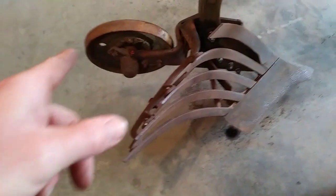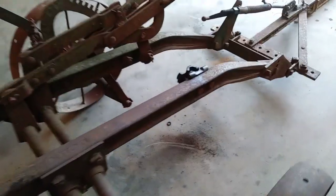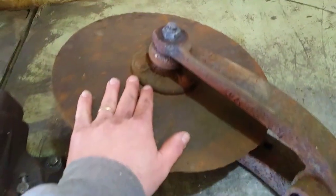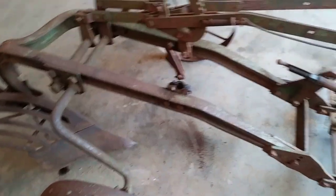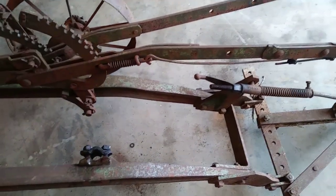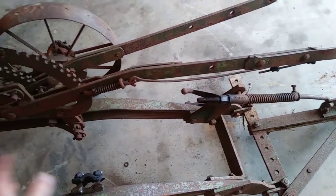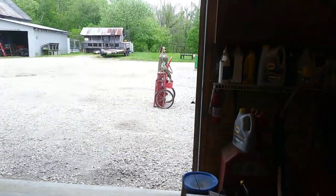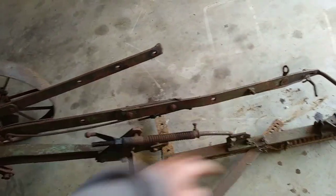We got the bottom mounted and the tail wheel on there — you can see how good that tail wheel is spinning. I've moved my attention now to this coulter. There was a mount here for a coulter cleaner — a little blade that would keep the coulter clean. I took that mount off and removed the coulter. For you guys that don't know: if you've got old rusty sticky stuff, hit it with a torch, get it orange, let it cool, walk away for a few minutes, and when you come back put a wrench on it and it'll break right loose.